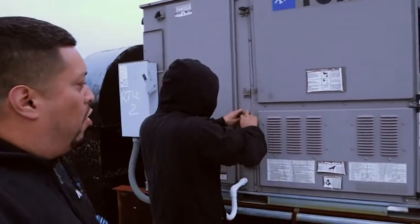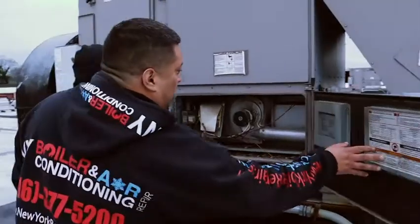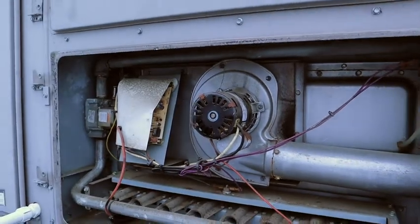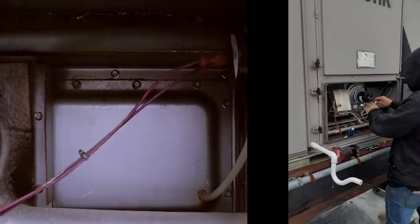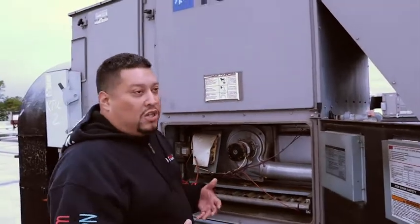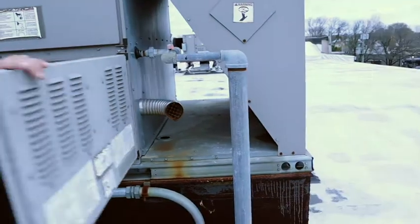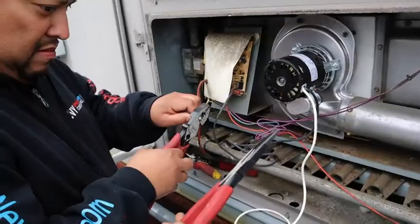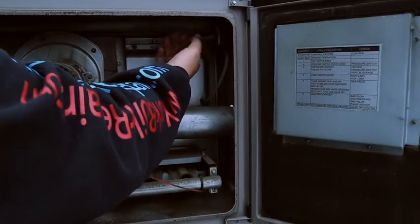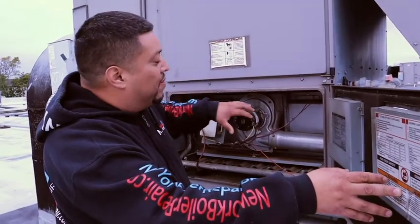So right now I have my assistant working — we're opening the door. This is where the fan inducer assembly is at. You see, it's called the fan inducer assembly, and this is what we're changing. We're also changing an air pressure switch right here. When the unit turns on and it's calling for heat, the burners turn on and the fan inducer motor also turns on, because it's creating a mechanical exhaust. There is no chimney, as you guys can see, so this is actually sucking the fumes and blowing them right out to the side, out to the ambient air. The purpose of the air pressure switch is basically sensing draft. If this motor is working, this senses a draft, and this tells the computer — via a micro switch inside — that everything is okay, basically informing the circuit board that the actual inducer fan motor is working.